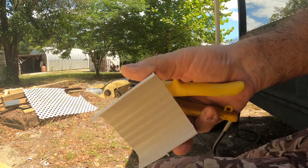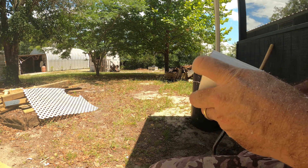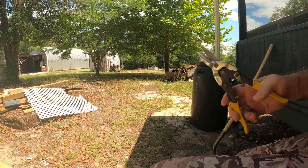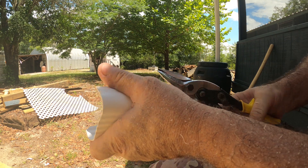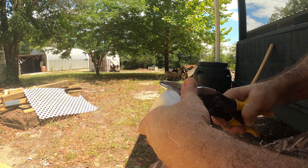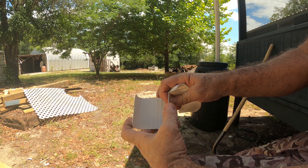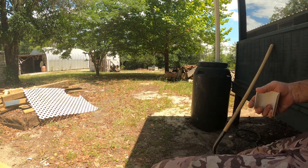These are clips that are going to hold the gutter on. We're going to cut these corners off - not only does it look a little neater, but there's less to catch on. Pine needles and stuff will just bounce right off. Now we've got two gutter clips. These will screw to the house, the gutter will go in there, and then we'll put a screw here and here in the gutter.